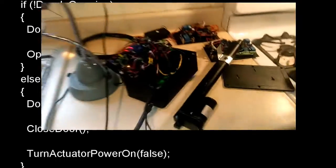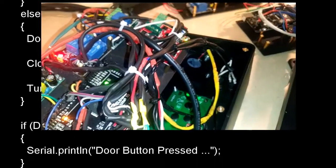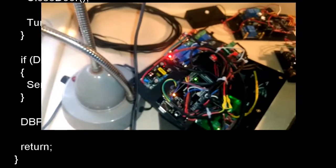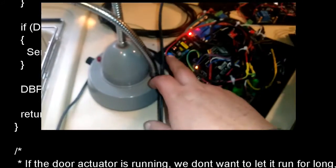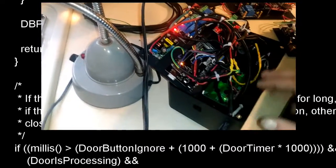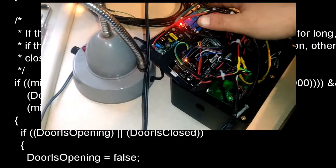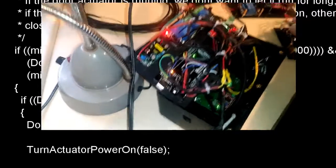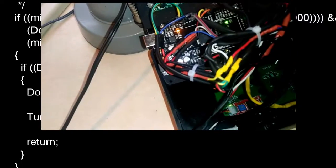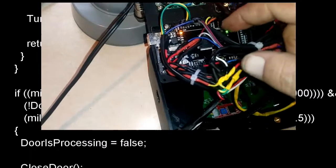So, I've also had to add a fan in there. You can kind of hear it and see it. All these electronics get a little hot. It runs off a normal household 110. And this right here converts to 12 volt, which runs the system. Then some of these things, like these two over here, these are the remote relays. They run on 12 volt. And this is an Arduino Mega 2560 microprocessor.